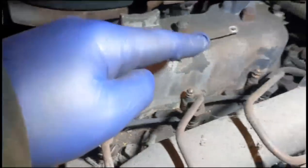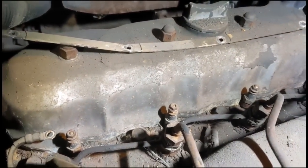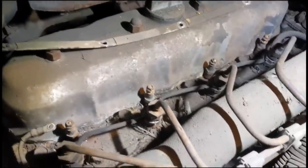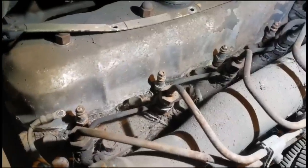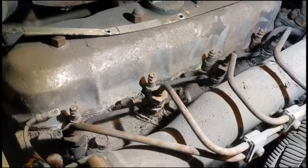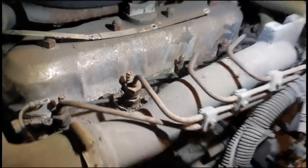What I'm going to do is take out the heater plugs and pour something into the cylinder, each of the four cylinders. I haven't quite decided what I'm going to put in yet, WD-40 or a little bit of diesel, I'm not too sure, but we'll pour something in the cylinders anyway and let that sit for a day or two and then we'll try and turn her over.